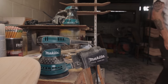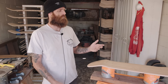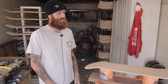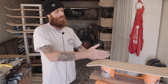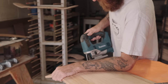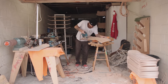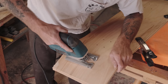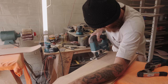Most of my templates I literally just draw half the board on a skateboard, cut it out, finish it, take a cardboard template from that and then flip it over — that's how I get a skateboard shape. A lot of those templates I'll blend; I like the wide points somewhere, so I blend the nose and tail together. That's where I get creative, just stare at the skateboards and wait for the shape to really come out. Most shapes go through numerous revisions to get to where I feel comfortable with them, then I just run with them and produce a bunch.